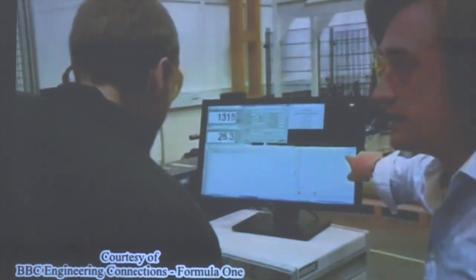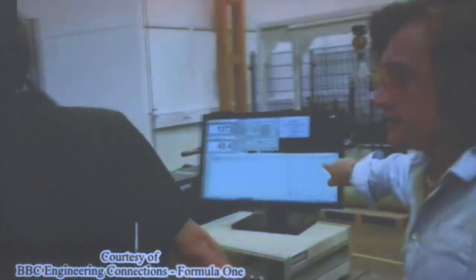That's the machine, it's distorting now, you should be able to see it necking. Necking, yeah, I know what you're thinking, but here it means when a material gets thinner in cross-section. It's an indication it's just about to fail. Oh yeah, there it goes, there it goes! It's gone! That's ruined. I think it is.